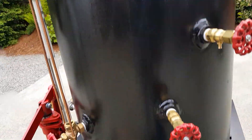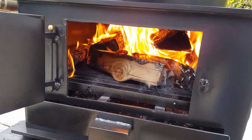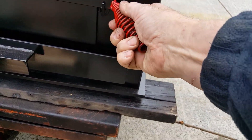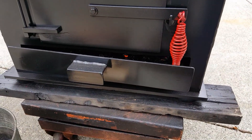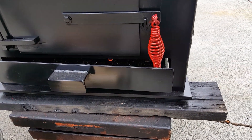I only use the blower when I put new wood in, if I think it needs it. You do have to have some boiler pressure. This handle is fairly new — it doesn't get hot at all. The ash pan and draft door are right here, and it gets a lot of air up through the draft door, up around it and into the fire as well.